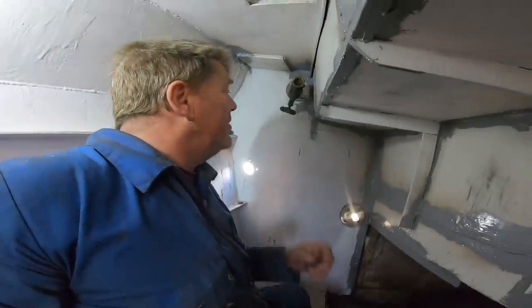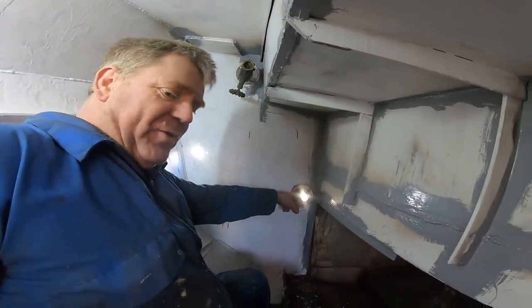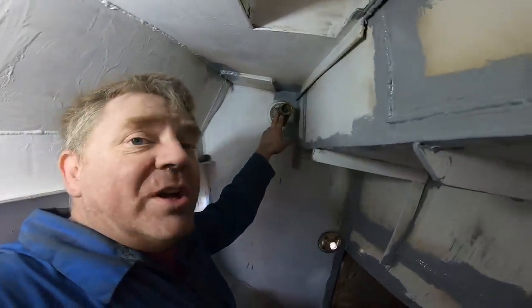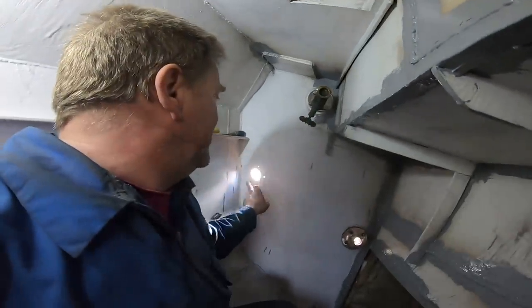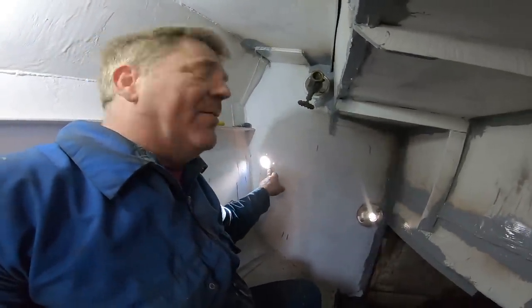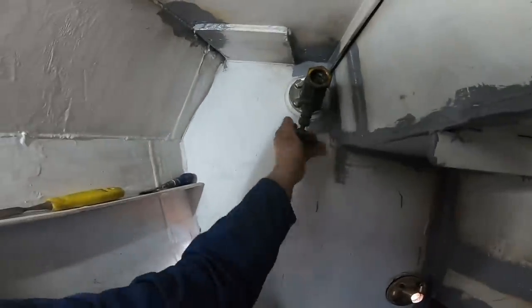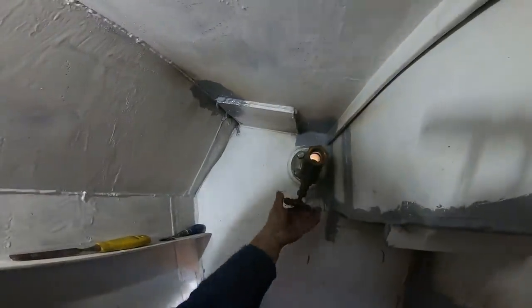So we've now got on the transom the bilge pump outlet for the bilge under the prop shaft, and the bilge pump outlet for the bilge under the engine, and that fitting, which is for the diesel heater, the Eberspächer. I can't find that one, it's in my shed somewhere at home. These fittings are very old, but they're serviceable. They're the old type.